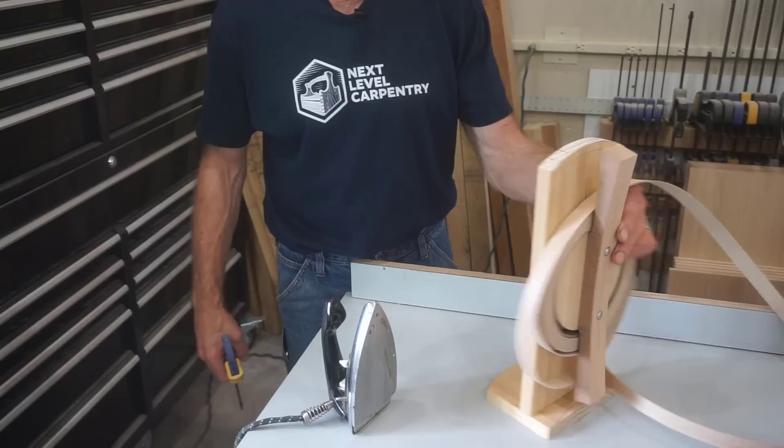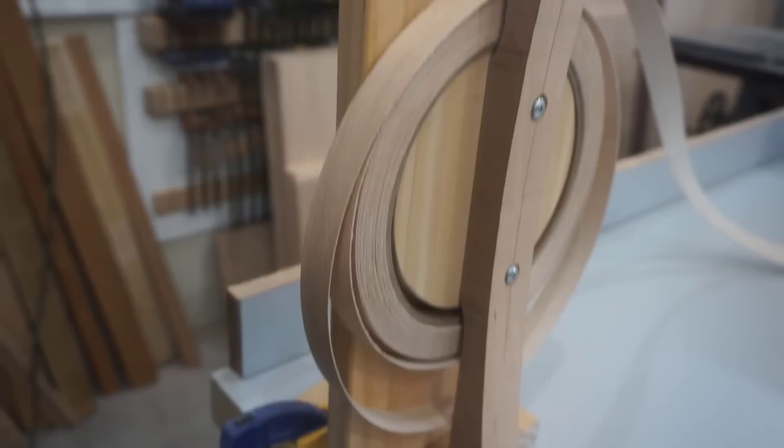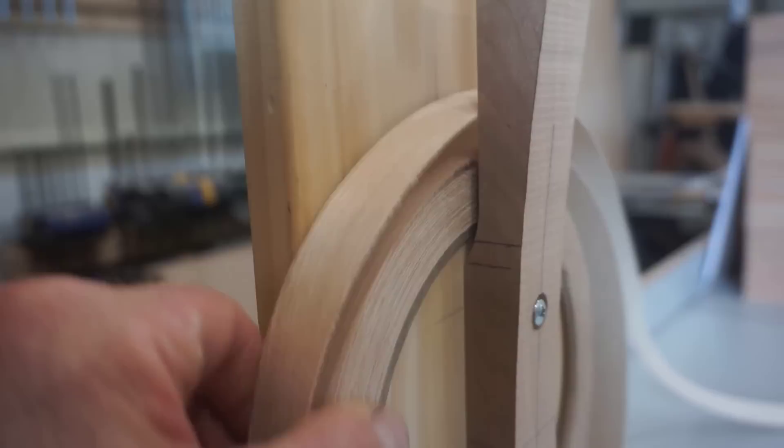So a tape dispenser reel like this one is real handy. I made this just so it clamps down and I can position it for the work at hand. Basically, a round donut in the middle is just a little bit smaller than the inside of my roll of oak edge banding. There's a relief in this piece right here so that the edge banding can spin around but not come off. And then a block glued and screwed to the bottom allows me to clamp this in other positions. Not fancy, but extremely effective.